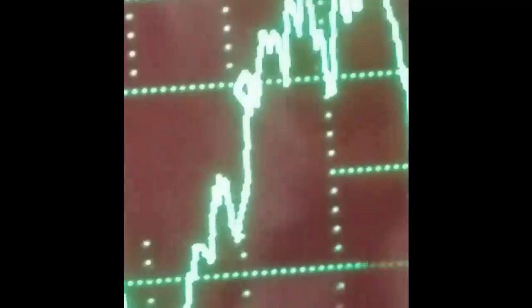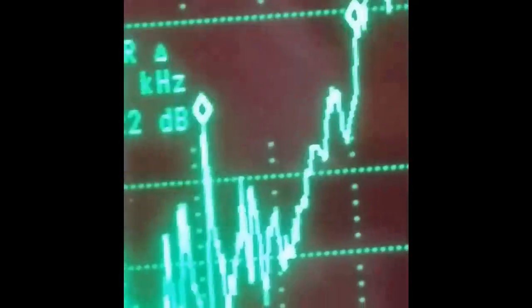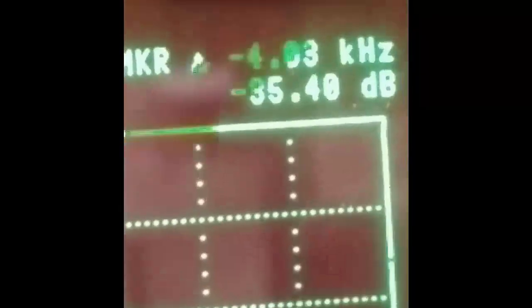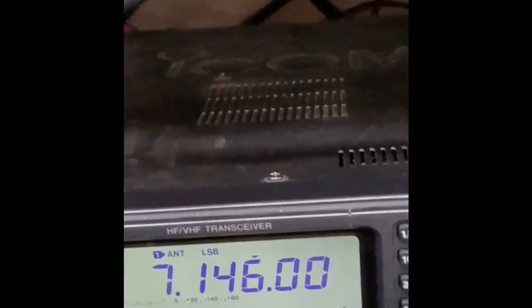This would be the top frequency of the voice channel. If I go right here and set the marker to this level as 0 Hz reference and 0 dB, and start tuning down from that — there's a little peak down here — we're 10 dB at 2 kHz. Then coming down lower, at 4 kHz down from the channel, we're at 35 dB. A lot of this is artifact in the actual radio itself. The amplifier is contributing a little bit, but this is kind of how the radio looks — with the radio running about 80 to 100 watts PEP driving three 572Bs.